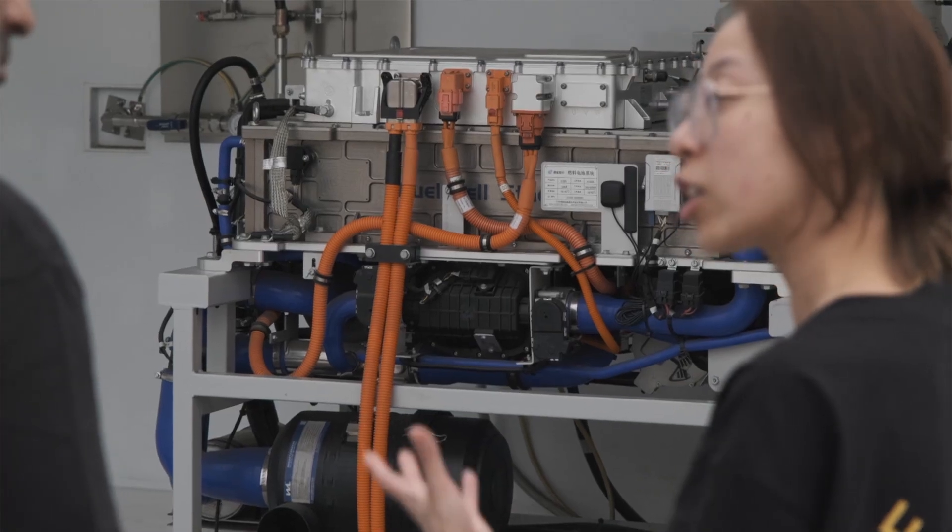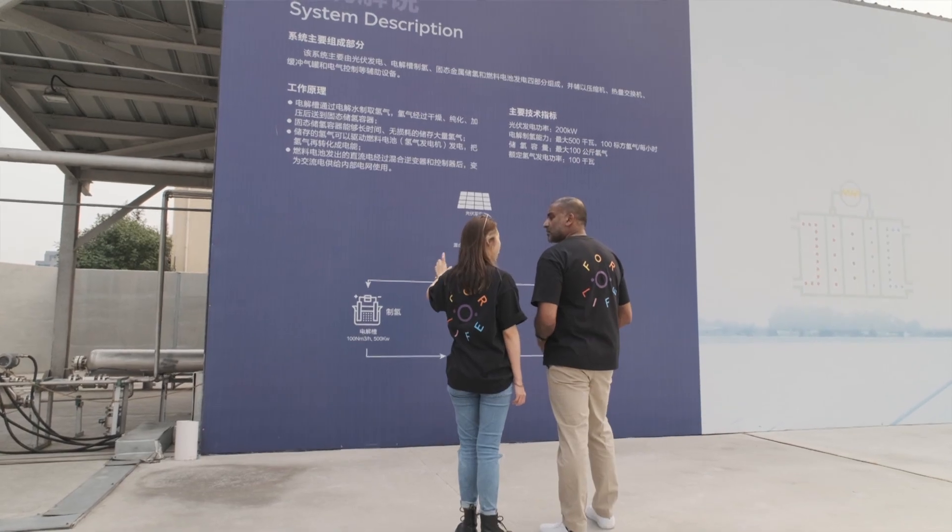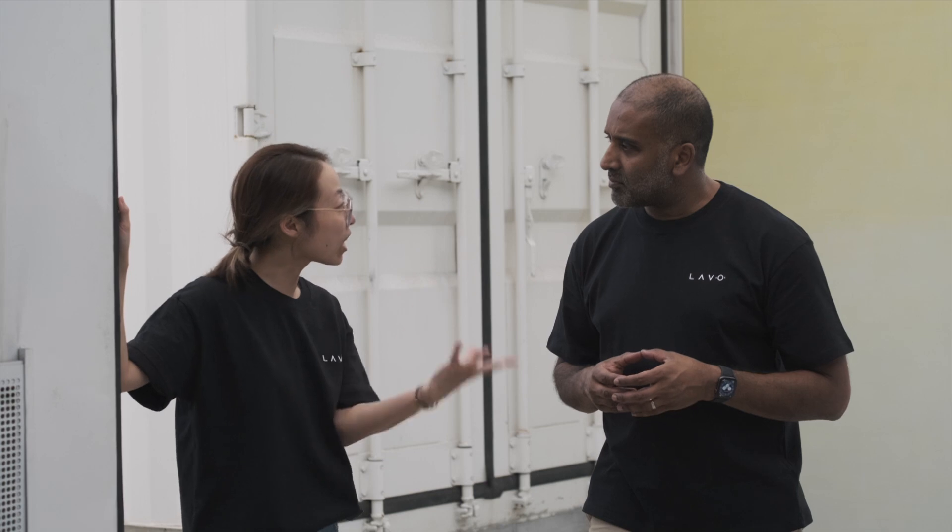So what do we have in front of us, Sherry? Because it looks just like something I'd find in a car — or a very, very large car. Yeah, this is our fuel cell system you're looking at right now. This is the equipment that's going to turn hydrogen back into water to generate electricity along the way. Give me the dummy's guide of what we've just seen in the entire process. So it's everything starting from the water. The water gets into the electrolyser and gets split into hydrogen and oxygen. Hydrogen is then stored into the metal hydride vessel. When the time comes and you need the hydrogen to generate electricity, you squeeze the hydrogen out of the metal hydride from the vessel, and the hydrogen gas fills into the fuel cell. The fuel cell combines the hydrogen and oxygen, turns it back into water, and generates electricity to power whatever appliances you want.